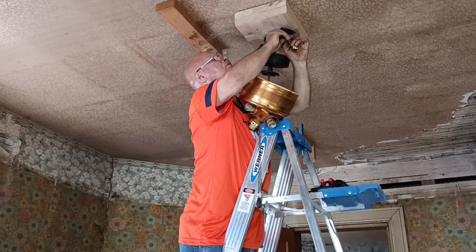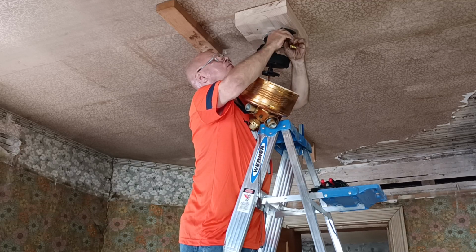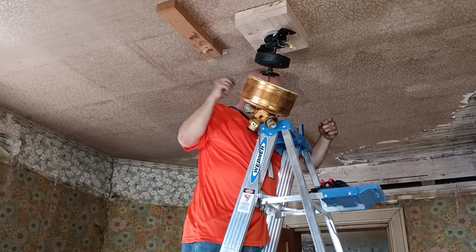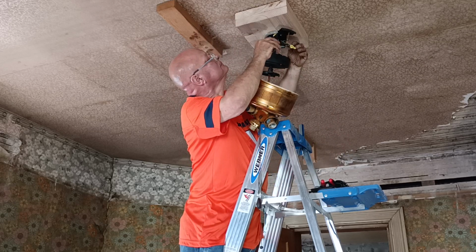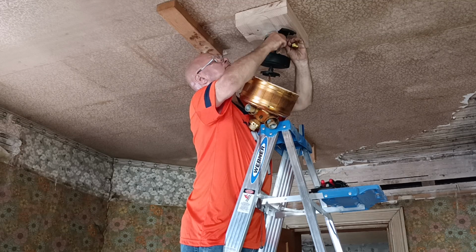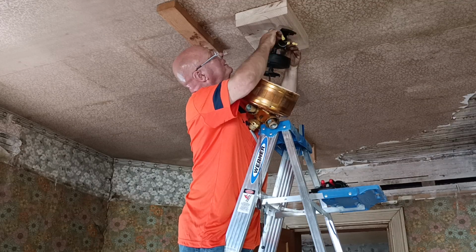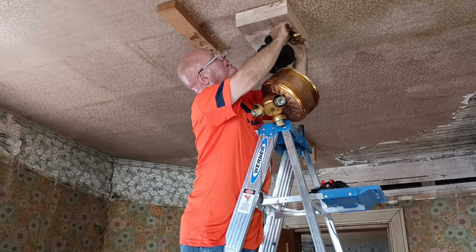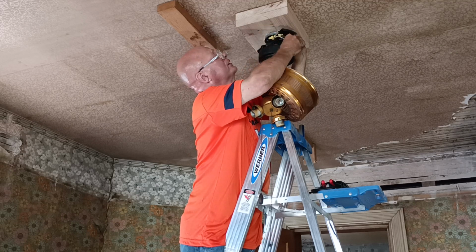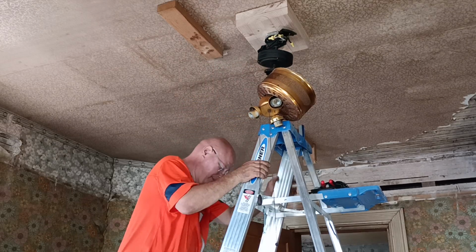Now we just took our two ground wires together, even though there's no ground up here, it's older wiring. We'll hook it up here anyway in case the other ground wire up here in the future if we ever rewire the house. Okay, so we're going to get our wires folded back into here so we can close this and not have any wires pinched. Unless I'm going to put them up here like this and get them back over this way and get them in the canopy. So I might do it that way. There's not enough room in there to put them.